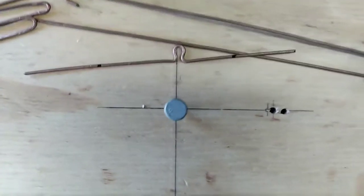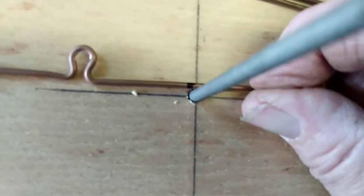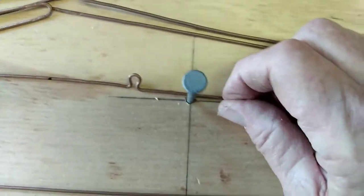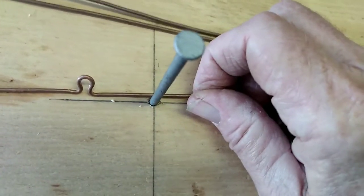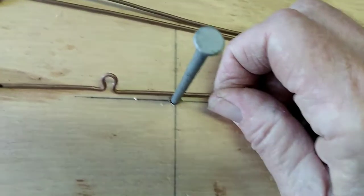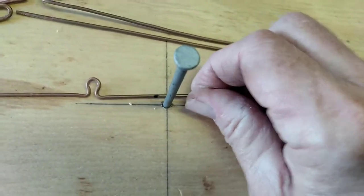It's quite nice, and you want to be able to look down on what you're doing. You want to be able to get your little mark right behind there, and when you bend, you can keep an eye on that mark, and you can see if you're going off one way or the other. That keeps your bend accurate, your copper the same length as it should be, because sometimes when we're making phase lines, we're consuming a lot of copper, and your copper is not cheap.